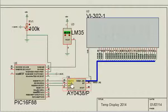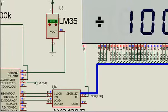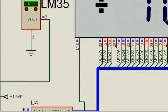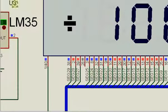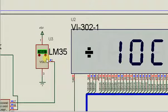By running the system simulation, we can verify whether the microcontroller can process the analog temperature values from the LM35 sensor and display the correct temperature values on the segment LCD. We can observe that the current temperature value of the LM35 sensor is 10 degrees centigrade, which is correctly indicated